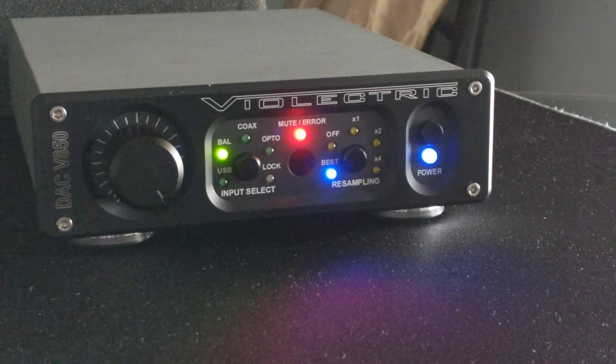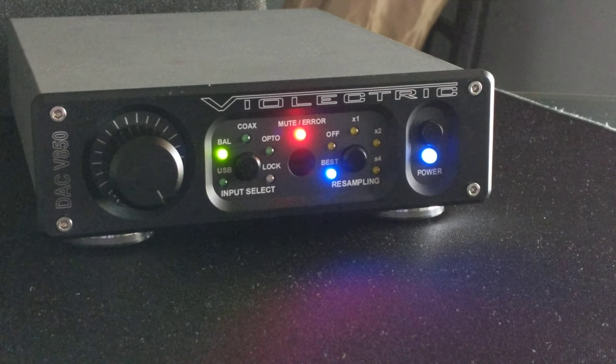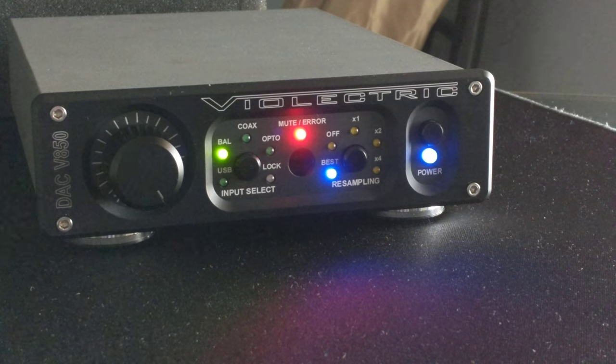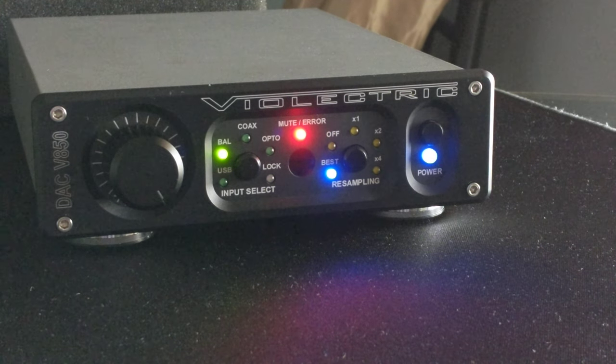The other knock against it would really be that it uses two Burr Brown 1795 DACs running in mono mode on each channel, which is great, but that chip really saw its heyday probably close to 10 years ago, and there's been a lot of DACs that come out from Sabre and AKM that objectively measure much better. The founder's argument is that he doesn't believe those DACs necessarily sound better, and he thinks that everything beyond this is scientific advancement for the sake of advancement. This thing measures something like negative 110 dB THD+N, which is all the better that microphone inputs can do today. So his argument is you're not gaining anything that you're audibly hearing, which I can see.